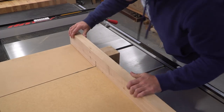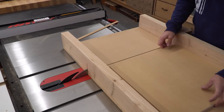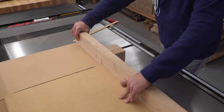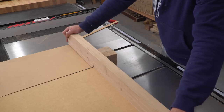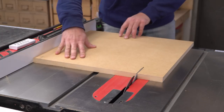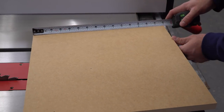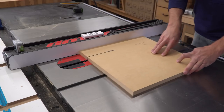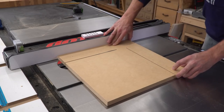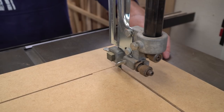At this point I'm moving on to the fence. This technique for making a fence is definitely not an original idea on my part — I got it from a video William NG put out called 'Two Cuts to a Perfect Miter Sled.' I'll outline the steps briefly, but if you want his very detailed explanation I'll leave a link in the description. I used my crosscut sled to make one perfect 90 degree corner, then set my table saw fence to 15 inches and cut the two opposite edges down to size, leaving me with a perfect square. Next I set my fence to 3 inches and cut most of the way along one side, then flipped the board and did the same to the perpendicular edge. I moved to the bandsaw to finish the cuts and was left with an L-shaped piece that had a perfect 90 degree point.